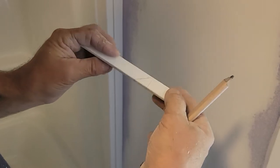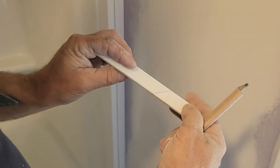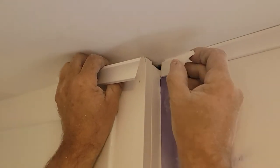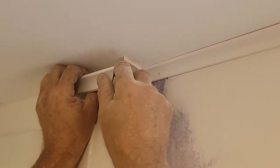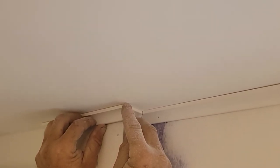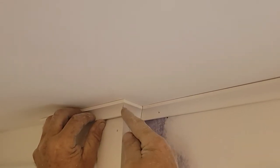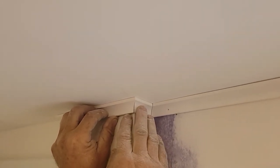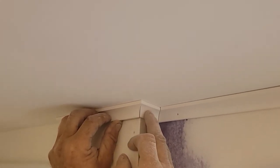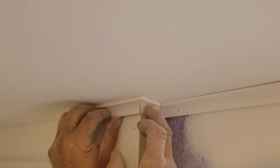So this is an outside corner. See that? So that tells me that I cut it properly the first time. So I'm gonna put this little piece up there. And I'm gonna put this up there, which is a cutoff. Again, I didn't waste it to make one. But you see how nice that outside corner will be? There's a little tiny gap there. So I'm gonna fine tune that. And then this is gonna get caulked and painted. And I'll probably glue the little guy on.